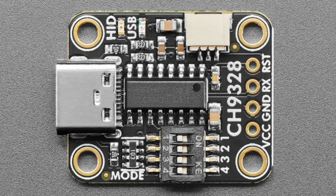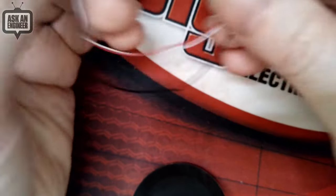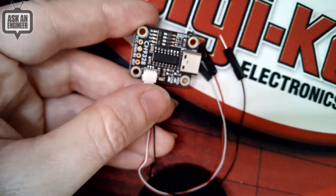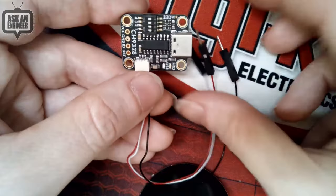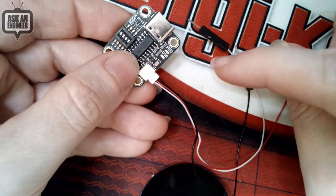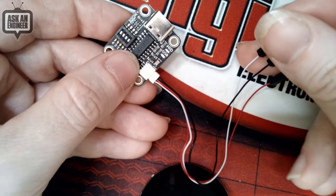And then we also have a little port on the side. Maybe go to the first image, 04. It's a JST SH pin connector. So if you want, not even solder, you can use a cable. You can go to the overhead really fast. You can use this cable if you want to not even do soldering. I'm trying to make as many projects and products solder-free as possible, so people can just plug in cables. And then you can have data on the white wire, and then you get 5 volts out here. And then this is the common ground.